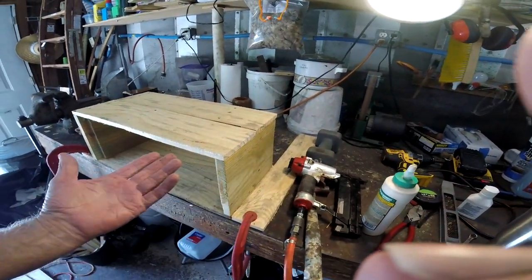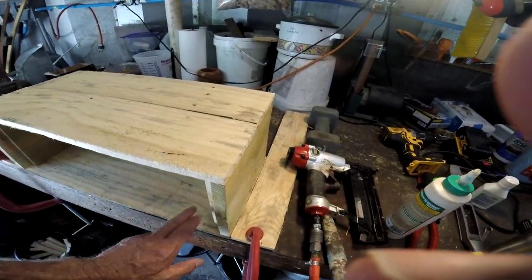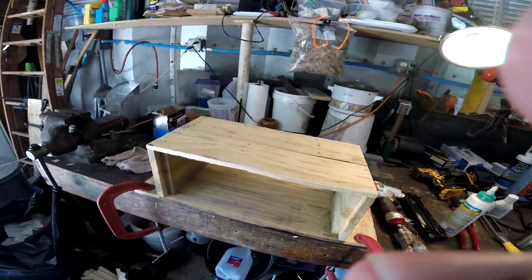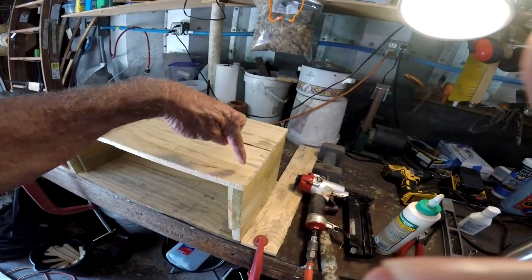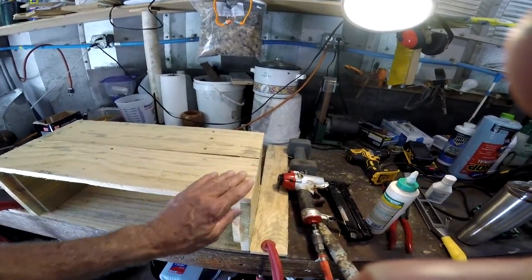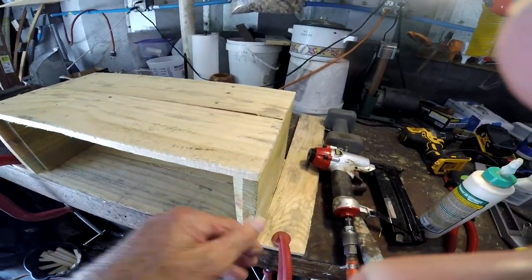So what I did, this sits on the table flat. That's the beauty too of the 2-inch material. It's easier to put together. And once you do get it screwed together, you're screwing this in here, you don't have blowouts. I mean, unless you're putting this in by braille or something, you won't have a screw going through this because you're working with 2-inch material, see?